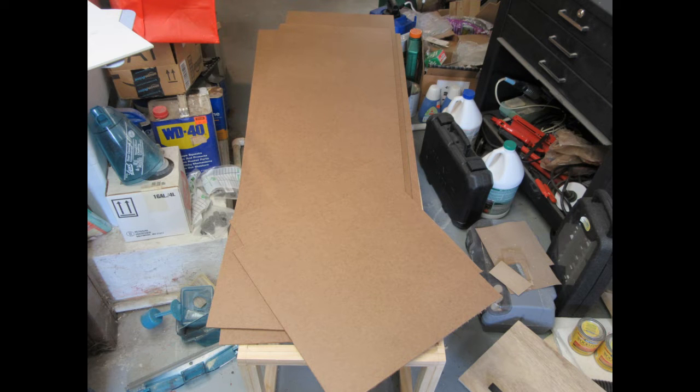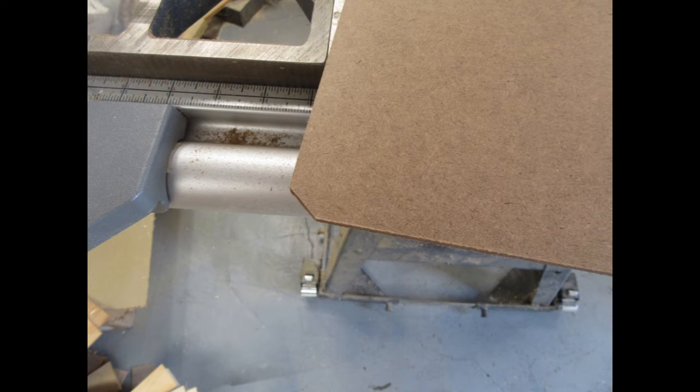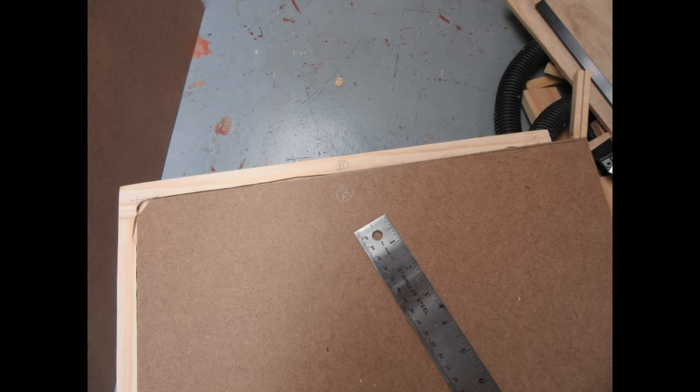The 6 panels are initially cut out to be about 2 inches greater in each dimension than the actual inlaid panel dimensions. I start by cutting off one corner of an inlay panel, which is necessary due to the rounded corners of the inlay areas, a result of the routing process. I fit the trimmed corner of the panel into one corner of the first inlay area, pressing the long side firmly against the long edge of the inlay area, which is the left side in this photo.